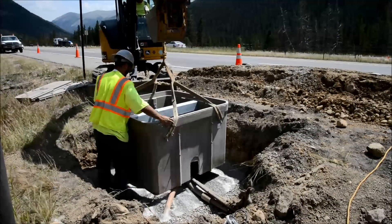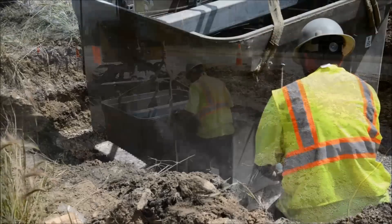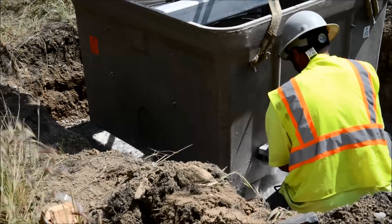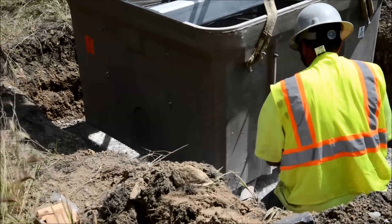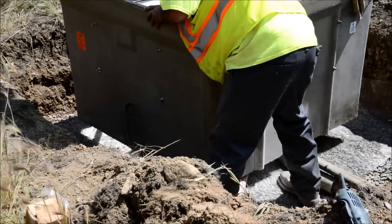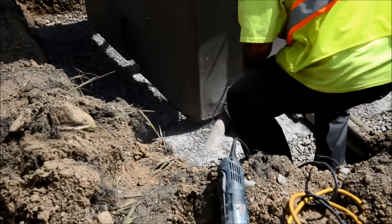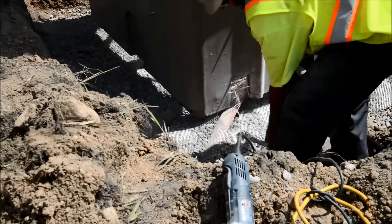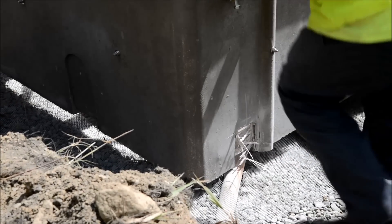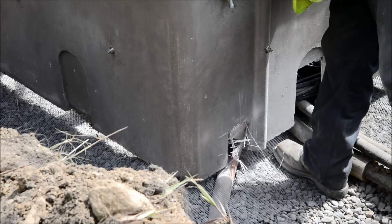Position the enclosure in the hole and note all conduit paths. The box might need to be cut to accommodate existing conduit paths. When cutting, use a diamond tip masonry hole saw or a cut-off grinder. Do not cut the enclosure's corners and do not remove more than 25% of any sidewall. Avoid cutting any ribs on polymer concrete boxes. When removing a cut piece, use gloves to avoid getting fiberglass shards embedded in your hands. Knockouts and terminators can be pre-installed at the factory to save time in the field.